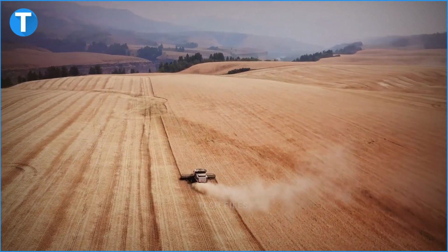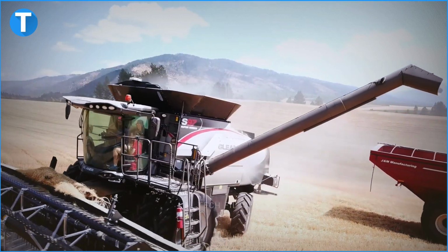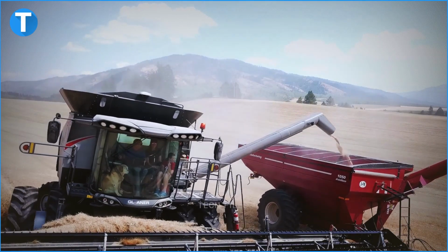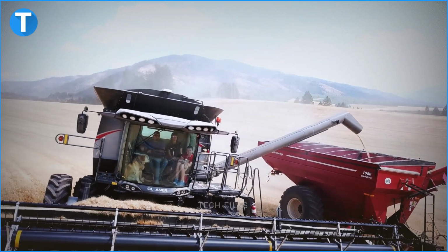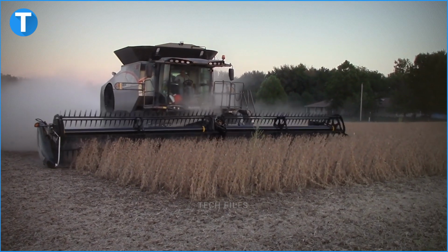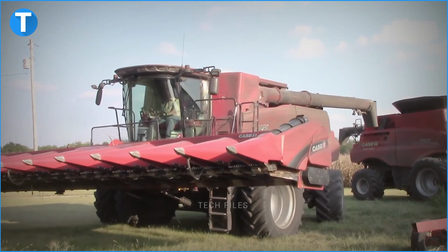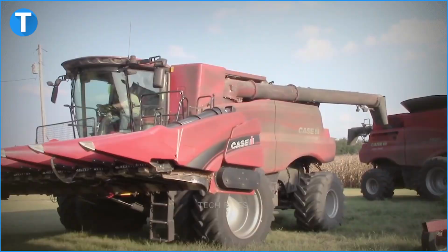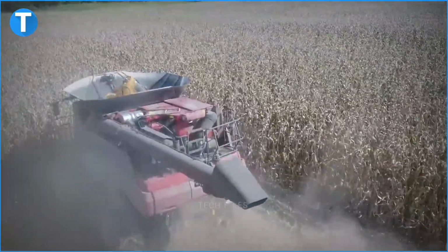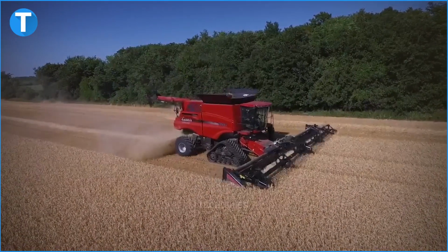Pushing is a relatively new procedure for canola harvesting that has been suggested as a faster and less expensive alternative to swathing. A pusher is mounted on the three-point hitch of a bidirectional tractor, and it is driven through the canola at a relatively high speed to force it to lodge. The idea is that by pushing the canola over, it is less susceptible to blowing in the wind, which causes shattering.